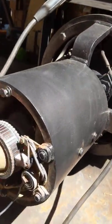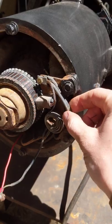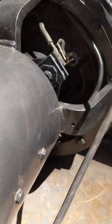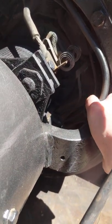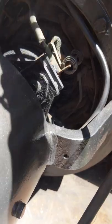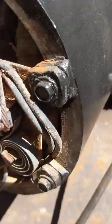Another wire coming out of the housing is my right brush holder. On the short hoods it's all wired in series - there are only three wires. You have two coming off of your positive brush holder: one ends up going into the shunt coils in the generator, which in turn goes to the other shunt coil and back out - that's what the rheostat is controlling. The other is your positive, which helps complete the whole circuit of your outlet.